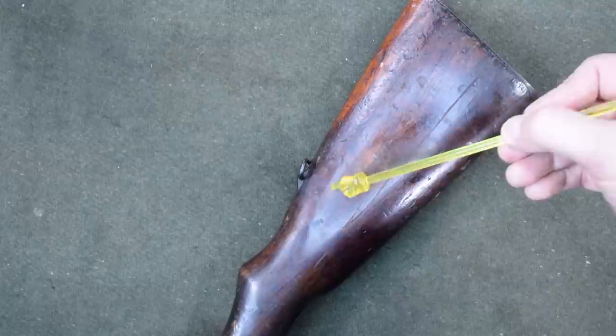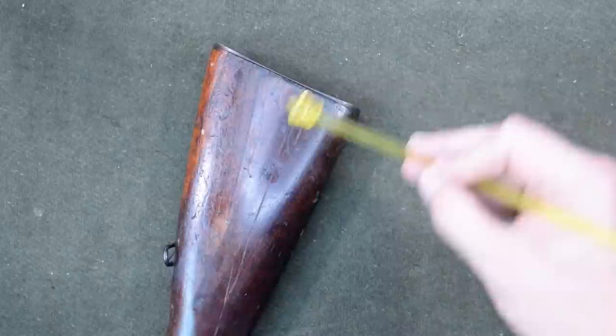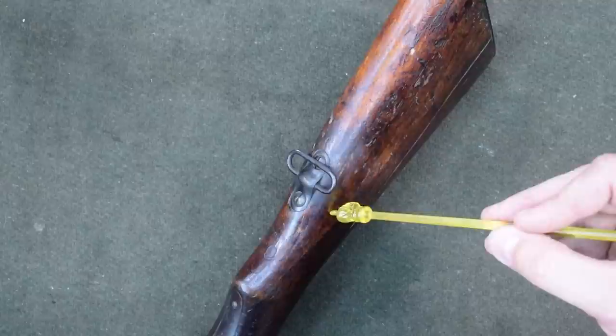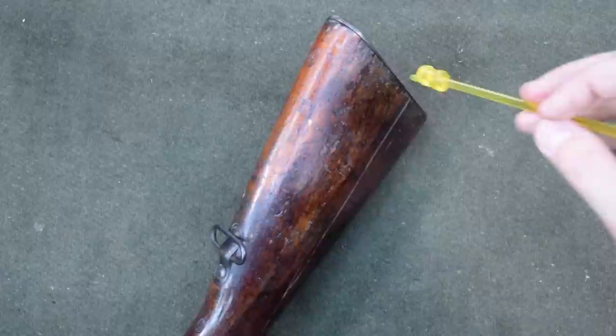One, the butt plate has a screw here and here in order to make sure that it's secured one section to the other and that it can't back out from its dovetail. And two, the leading screw on the swivel here is actually long enough to go all the way down into the second piece of wood, therefore tying them together at the front and at the rear. A very good system for making use of lighter wood, keeping very strong grain boundaries, and reusing materials.